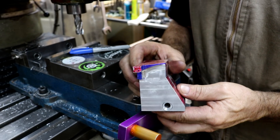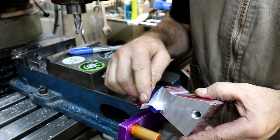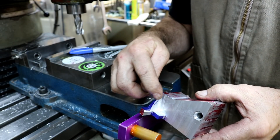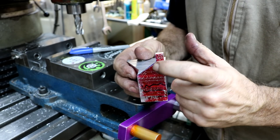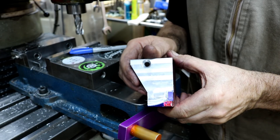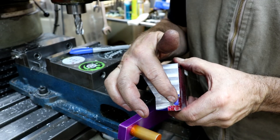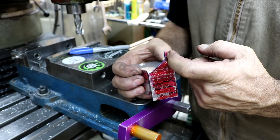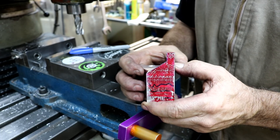This is really shiny and it's very hard to see the curved profile here. Looking down from the top, it's also sloped here in the front, but it has a curved profile on the inside looking down on it. Then we have this little stop section here, and we need to put a hole in and thread it quarter-20 right where I drew the circle.